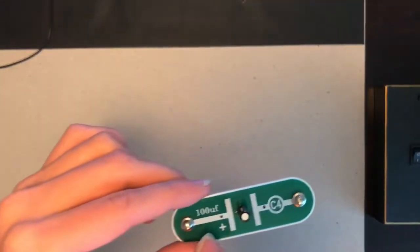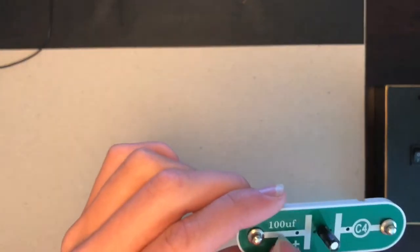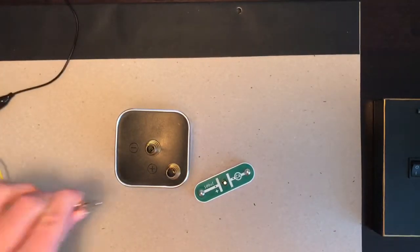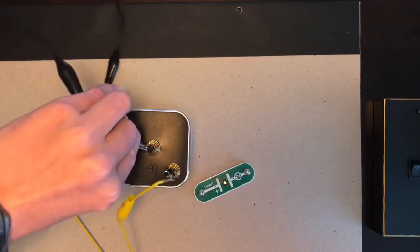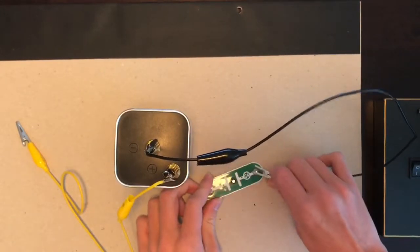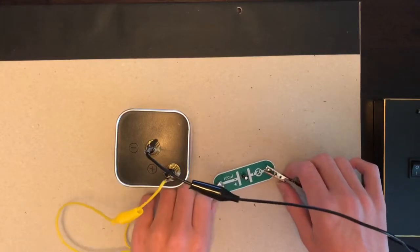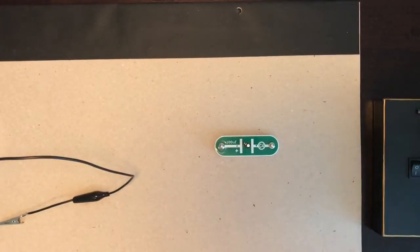The international standard unit for capacitance is the farad, which is one coulomb per volt. This capacitor I have here is a 100-microfarad capacitor, meaning it can hold 100 millionths of a coulomb per volt supplied. Capacitors tend to have really low values in farads. Now I'll charge up the capacitor using the battery — positive terminal here, negative there — and now it's charged up to six volts.